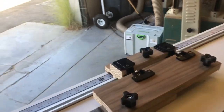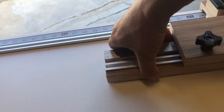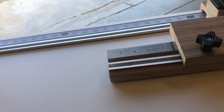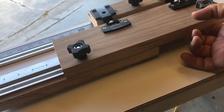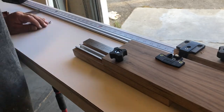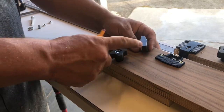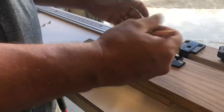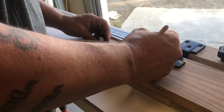You can see the offset now. If you want exactly a five-inch offset, just set that to five inches, tighten it up, and your molding will come underneath. I got to put the leveler on here so I can raise and lower it. There's no rocket science to this — the only reason I waited until now is I wanted to make sure everything slid and it wasn't going to interfere with anything. You don't want this knob to collide with that knob or hit the hinge. Now knowing I'm good, right there is a good spot.